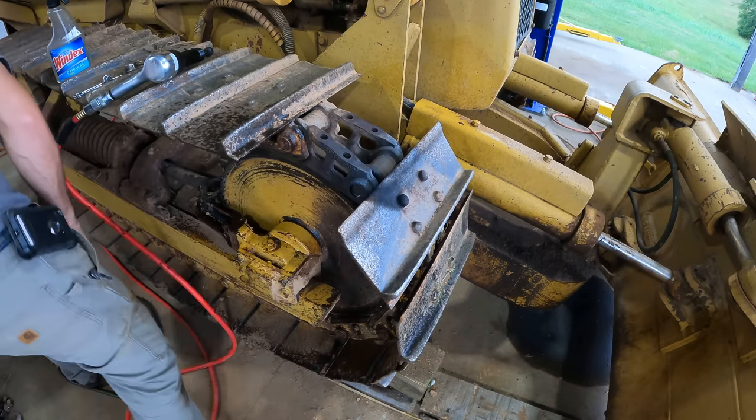I've got to move the dozer. What a pain. Got the dozer moved forward, had to jack it up again, rotate the track, get it in the right spot, and set it back down. So now we are ready to do some pin removal, but I just realized I'm about to run out of acetylene gas, and of course it's Sunday so I can't go pick up more today. I'm going to do as much as I can with propane — I've got my weed torch — and then maybe take it a little bit hotter with the acetylene I have left.